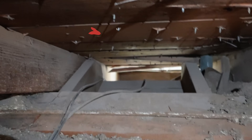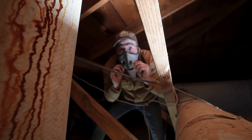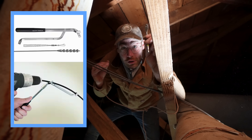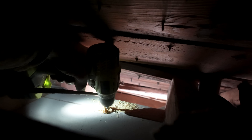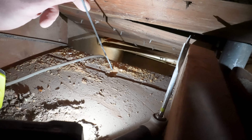I can see the top plate — it looks like there's just enough room to squeeze in there with a spade bit, but no matter what it's going to be tough. I'll try this with the traditional spade bit, but they also make flexible bits if you're in an even tighter area. I should have drilled this hole closer to the middle of the 2x4 instead of the edge. When I tried to get my fish tape through, I realized I didn't get my bit through both of the 2x4s. So I got the right angle drill attachment, which I should have used from the beginning, to get a more on-center hole, and then I was through.